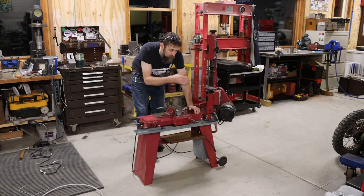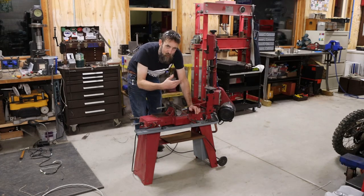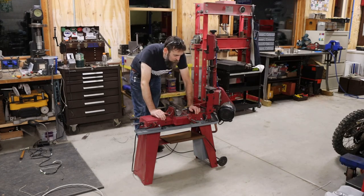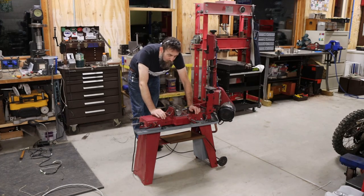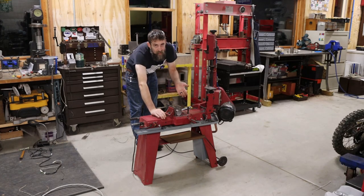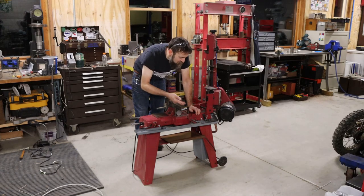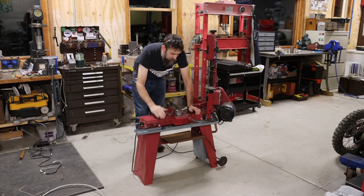Now you can run this saw in the vertical position with coolant on it, and this pan contains it all, but anytime you're going to cut something large, you could expect it to run right off the part onto the floor. So, you know, that is what it is, and you could make your system as big as you wanted. But my use for this saw is primarily in the horizontal. So not a large amount of coolant, so when that time comes to change it, there's just not that much to deal with. It's a pretty minimalist system, and it doesn't sling coolant like I thought it would, so that's a good thing. So that's it, I think. I'm glad I did it.